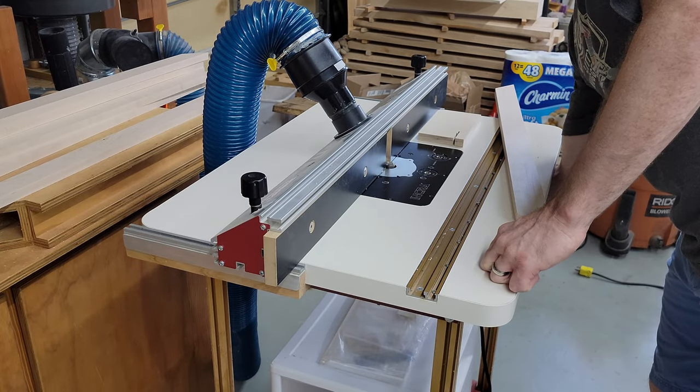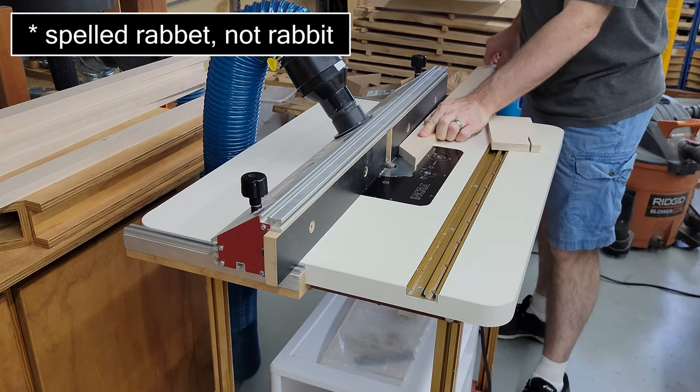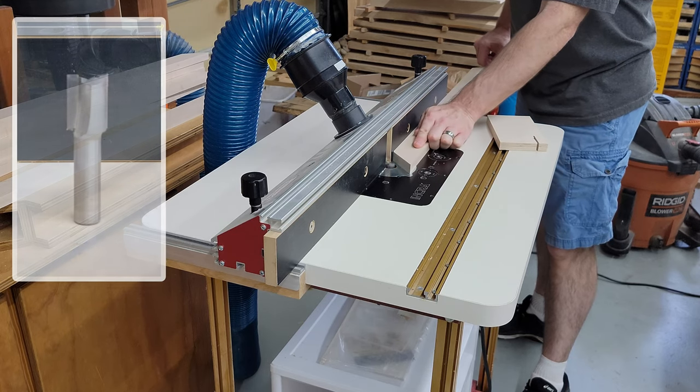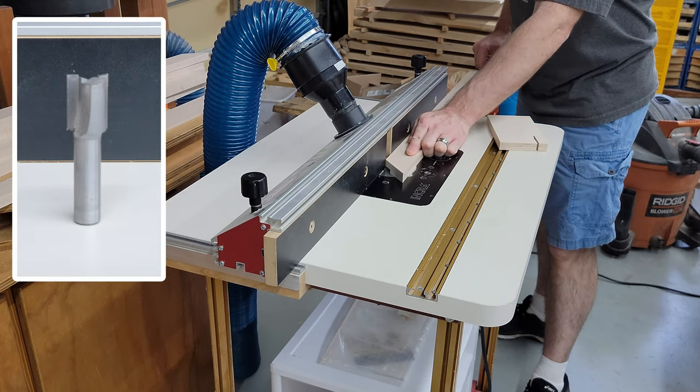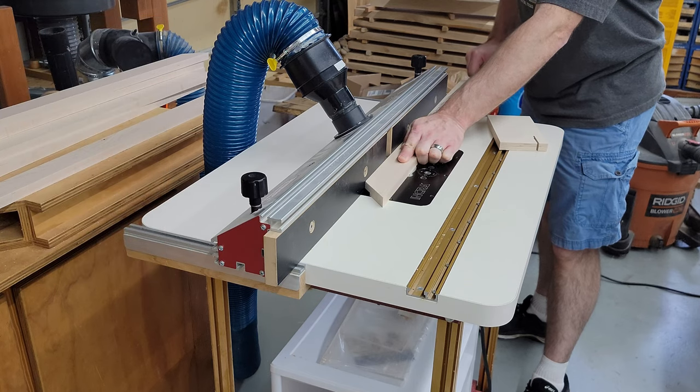This was a good time to start cutting out the rabbets in the back of the frame to hold the poster and acrylic sheet in place. You can cut the rabbets before cutting the miters, but I usually try to cut the miters before doing any edge detail on the board. The main reason for this is support. I want to prevent chipping on the corners.